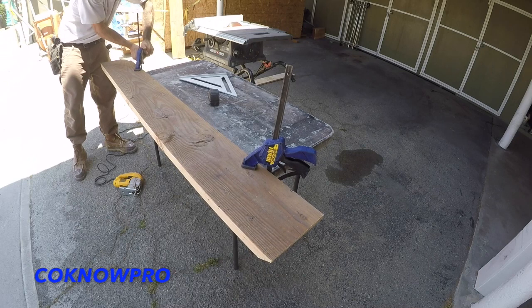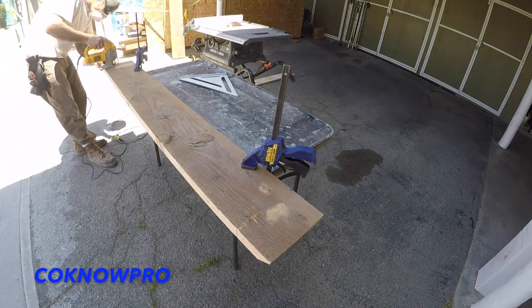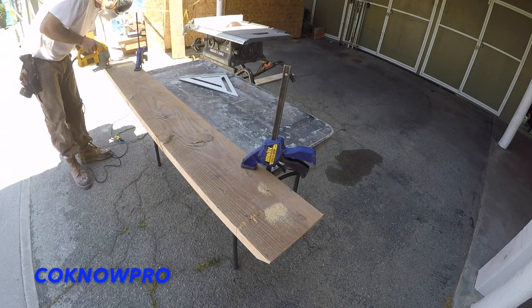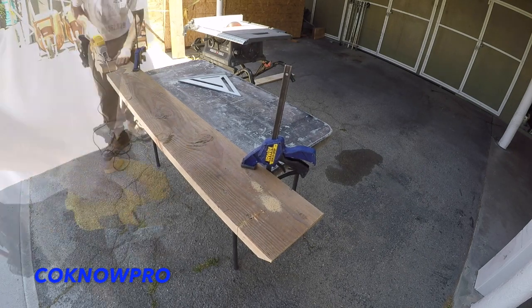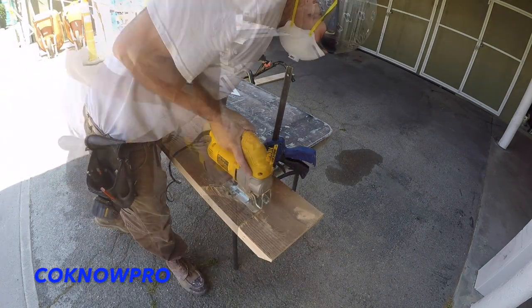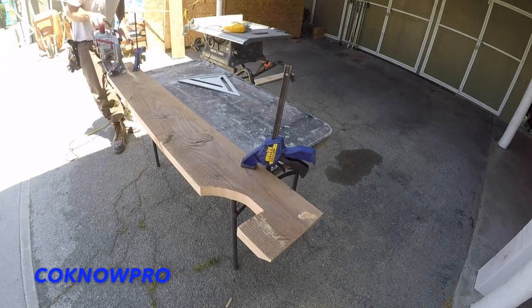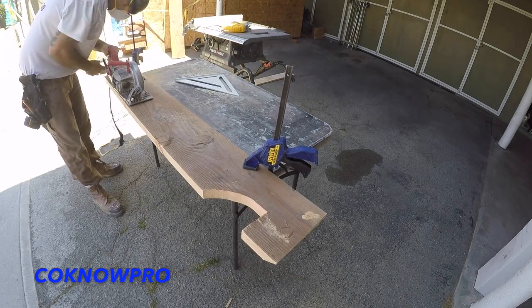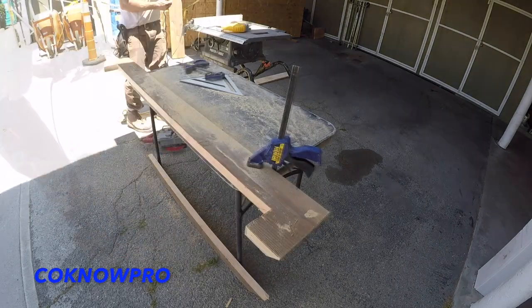Right here we're cutting in the notch for the fireplace. Basically the fireplace, let's say it's 70 inches. We measured our 70 inches, and we went in our depth so those two returns on the right and left could touch the wall. And we made our cut. We're using a jigsaw, and then we're going to use our skill saw. These are all just standard tools most people do have, so this is a pretty easy DIY project to do.